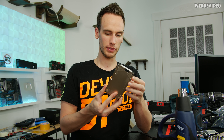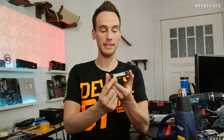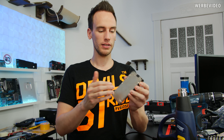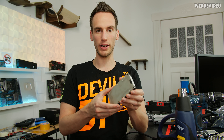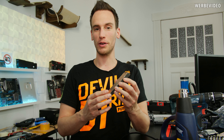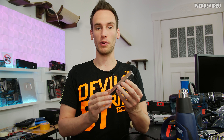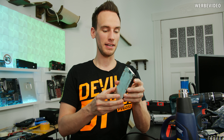This thing is really difficult and resistant to be opened. I found that the Intel logo on the side indicates it was manufactured in '98, which means it's 22 years old — that could explain why it's so difficult to open. The top cover is likely something to spread or dissipate heat, so it may be connected to the CPU die directly with thermal paste, and after 22 years it's very likely the thermal paste is dried out and completely sticky. It might help to heat it up a little. By the way, Itanium got the nickname 'Itanic' — very similar to Titanic — because it was announced as a can't-fail product and then sank like the Titanic.